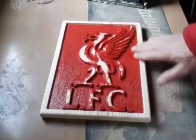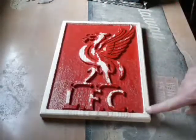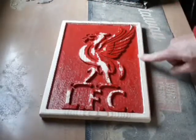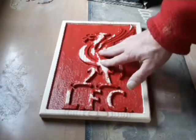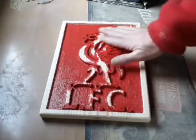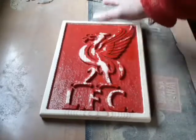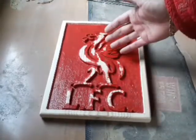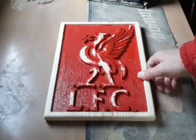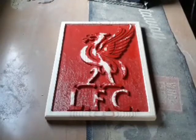Right, that's nicely dried now. I've removed the masking tape from the outside. I will put my linseed oil on here after we've painted it white. So I want to give it a light sanding just to remove that red. I personally would have left it with the wood showing and linseed oiled that, but the person wants it painting white, so what can we do? Light sanding and then we'll get on to the white paint.